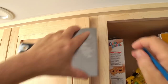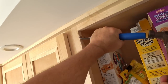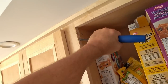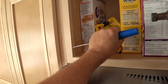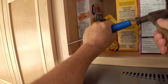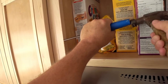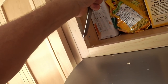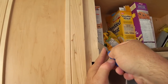I could resize the doors but that would mean redoing the finish on both doors as well. So I decided to mortise the hinges into the face frame on the cabinet, which gives me the clearance and I would only have to do that on one side. It would have been better if I had made sure the doors fit before finishing them — that was really a rookie mistake. Normally I hang the door to check the fit before sanding and finishing, but I didn't do that here and now I'm making up for it.